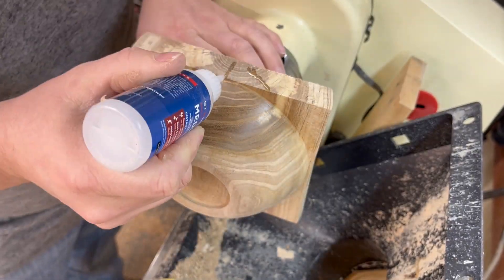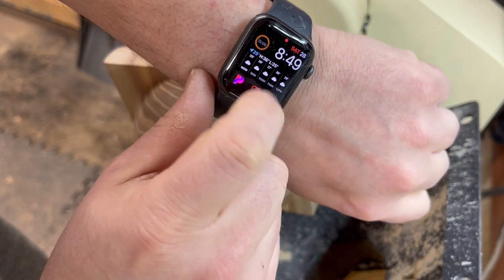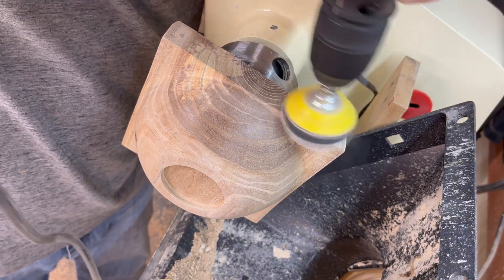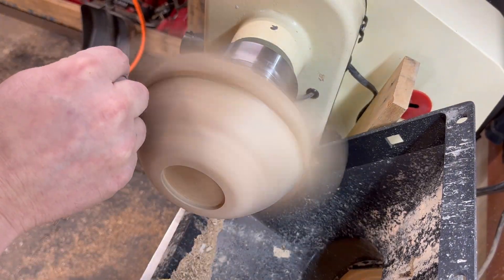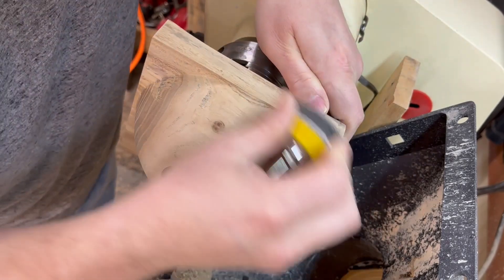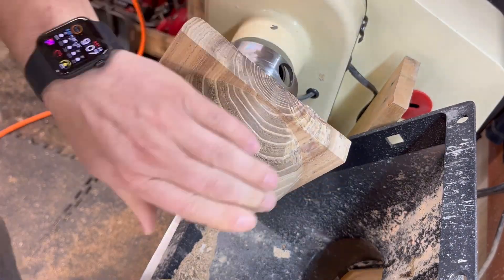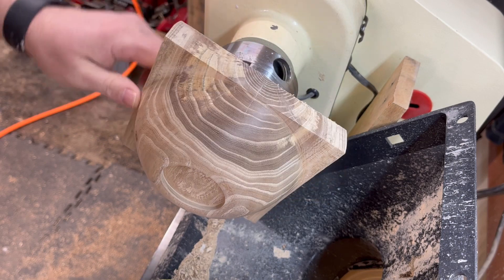I just want a little bit to help clean out the actual cracks, but I don't want to take it out of the end grain. Then I blow it out with the air gun and it's on to super glue — I use Starbond medium with the accelerator. You'll notice it's not sinking into the end grain, it's only going into the cracks, staying on top — that's what I want it to do. Then we set for another 15 minutes and walk away. Now I'm sanding just the CA glue, then I spin it up and sand the whole thing at 180 again, then back to it by hand. Once you get through 180, the 240, 320, and 400 go pretty quickly. I also sand inside the mortise too, because that center of the mortise is the final sanding for that. There we go — she's shiny.